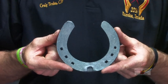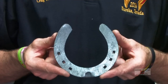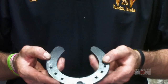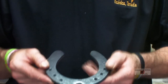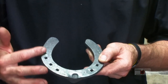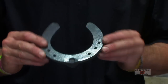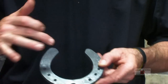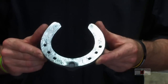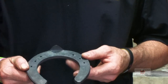We made a Novice front today. The shoe is made out of 11 inches of 3/8 by 1-1/4, so a little bit of work is going to go into this shoe. The mandatory specs are it needs to have a bob-punch toe clip and fit up for six E7s. It's got to be stretched a bit because 11 inches wouldn't even make a shoe that fit inside this shoe, so you've got to make it to an appropriate size dimension for an appropriate size foot.